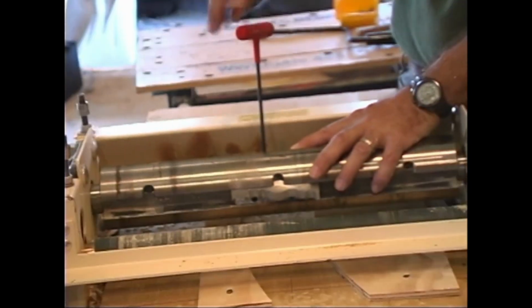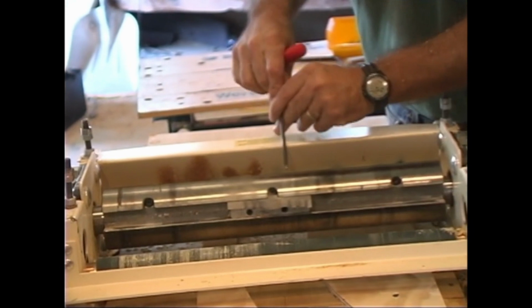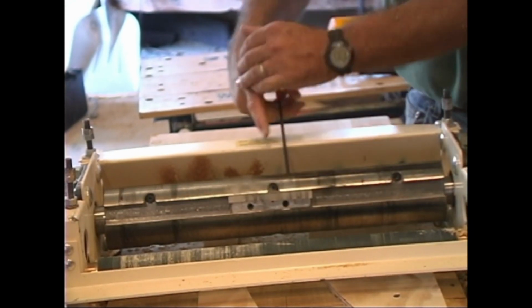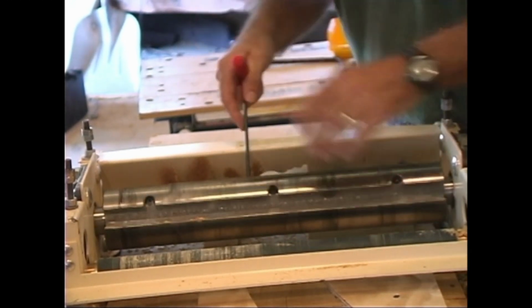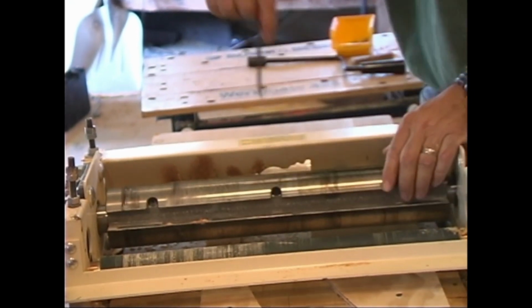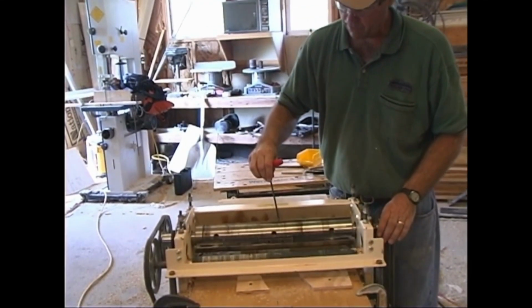And boy, it's really important to make absolutely certain that you get all these tightened in well. And if you're running a whole lot of molding, if you've run for a couple hours or so, you may want to stop and just recheck and make sure you've got everything tight. And remember, too, don't ever run the machine without the hood in place.